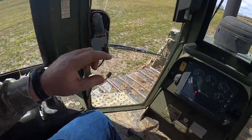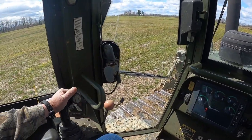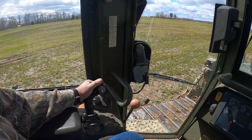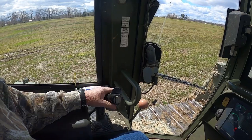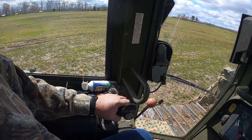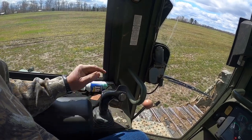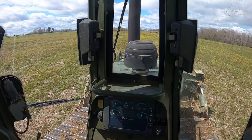So the screen is going to pop up, and it might say left counter rotate. That's going to be left. Push it on over, that's going to be counter rotate. So that's what they're calling for. When you go to calibrate the steering left or right, just the steering part, you go to here. When you go to calibrate, you're going to go on over. You can mess up with that real easy too. So that's the first stage of calibration of the sensors.